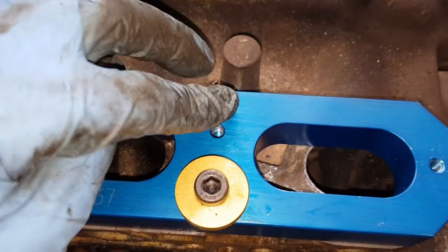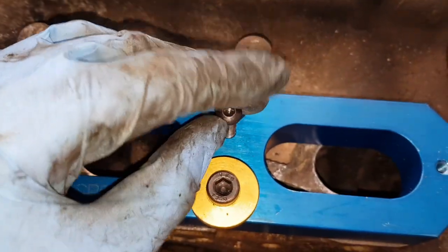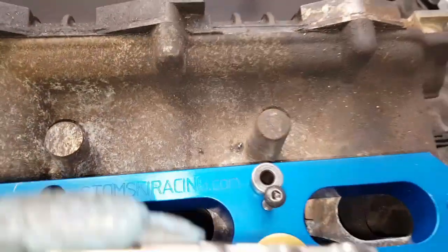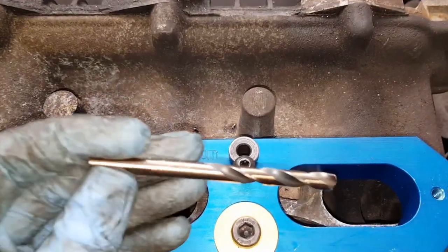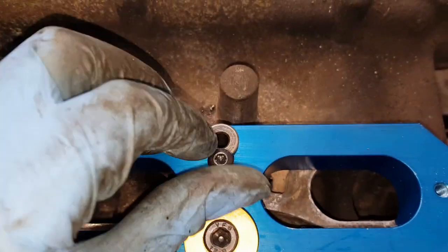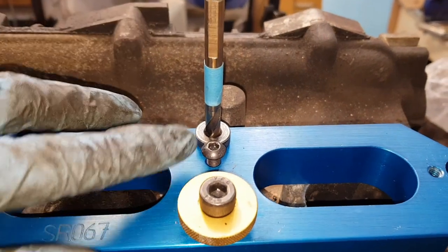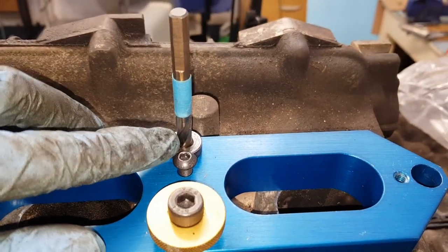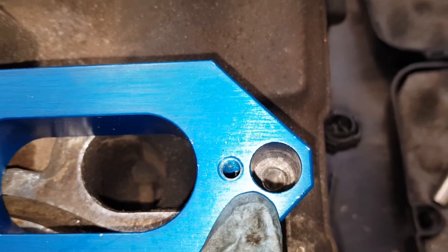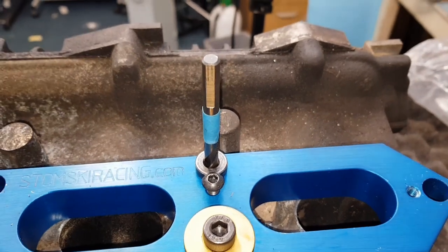I can now drill it out with the larger diameter drill. This guide goes in and is then fixed in place to stop it from moving. I shall be drilling through with this drill — it is a 17/64th drill. That's going to take out the centre of the stud so that all that will be left will be the threads, which will then be able to be removed. You can see I've marked the drill here — this is the maximum depth I can go. I measured the depth of the hole to make sure I'm not going to go through and hit the head. So with that marked up, I'm going to drill out the centre of the stud.